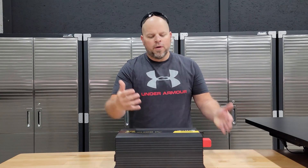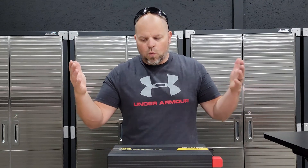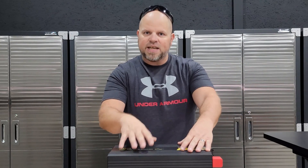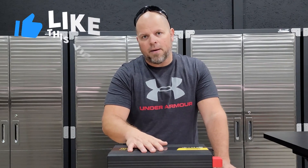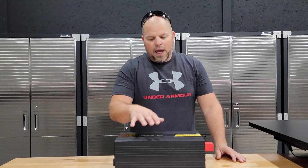Short circuit protection everybody should know — that's when something short circuits and causes a major problem. The overheating protection kicks in at 176°F; the unit will completely shut down to protect itself. For low voltage, when there's not enough voltage from the batteries — it shuts off at 19 volts, plus or minus 0.5 volts. You'll also hear an alarm start at 21 volts giving you a warning.